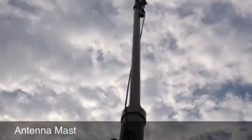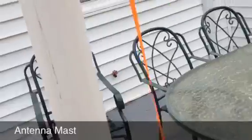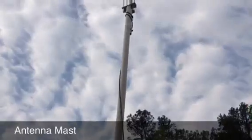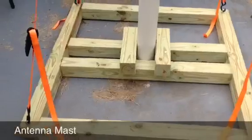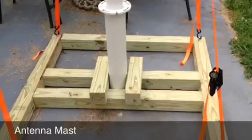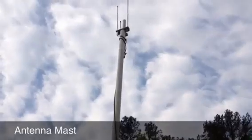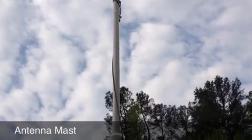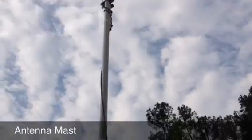We haven't figured out a way to really attach the cable yet — we've got to work on that in the next couple of days. Everything comes down into sections: a 5-foot section up top, a 10-foot section in the middle, and then your base. Everything was measured to fit between the fender wells of a pickup truck, so it'll fit in the back of a pickup or a mid-size SUV. You don't even need the extra tall section if you don't want it — you could strap just the top antenna section to a tree at your hunting camp.